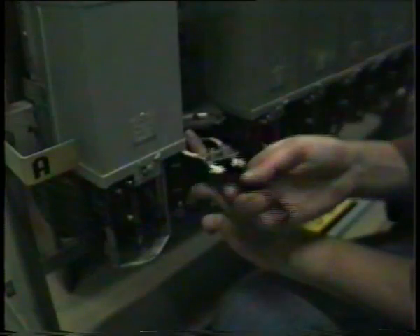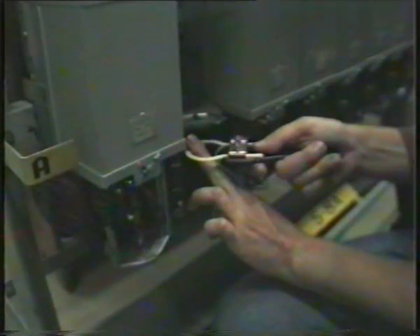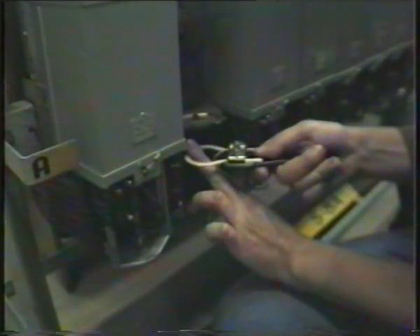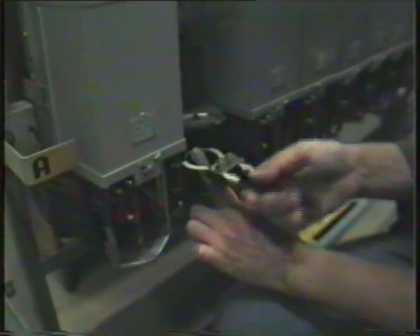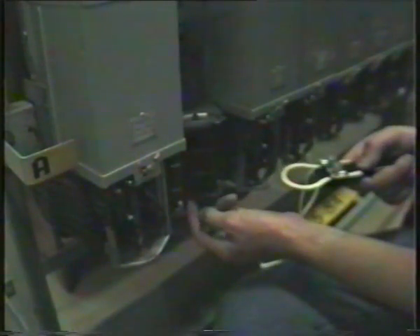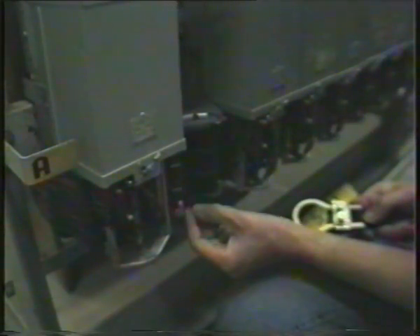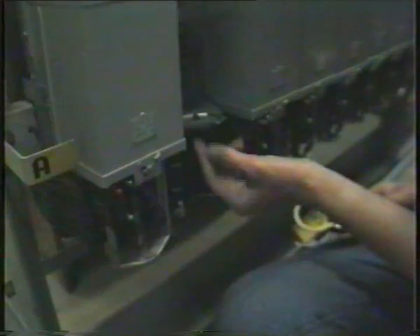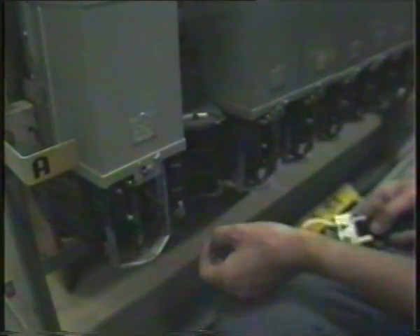Do you finally get belted by having your fingers on the bank like that? No. If a line just happens to be running all the time? No, no. I'm insulated here. This paint — it doesn't come back; it's not that good a conductor. It might actually go across the line there at the lowest. I won't get electrocuted in any way, because there's a contact on top and a contact below. You've got to actually short out both contacts.